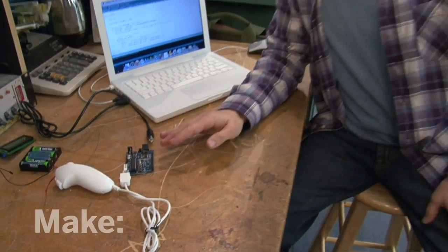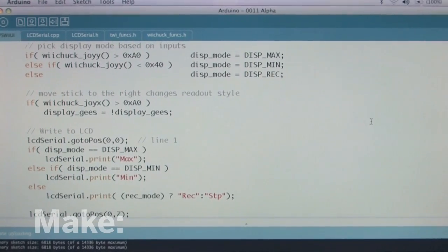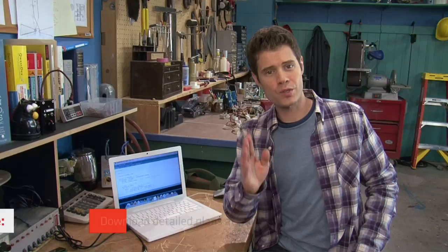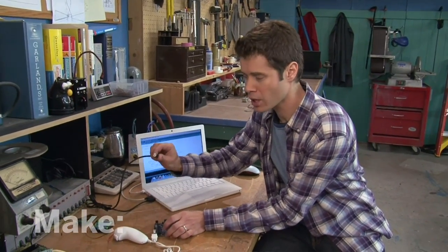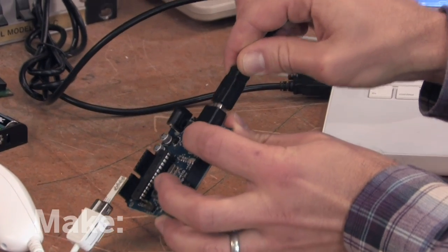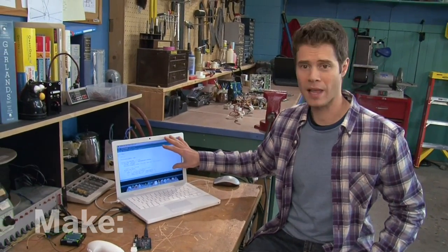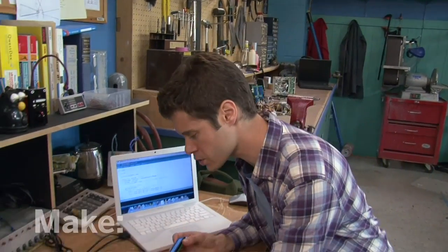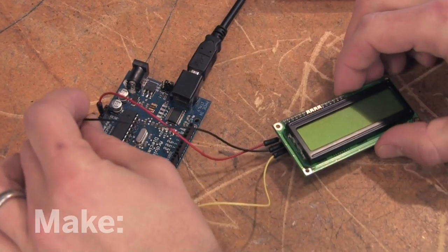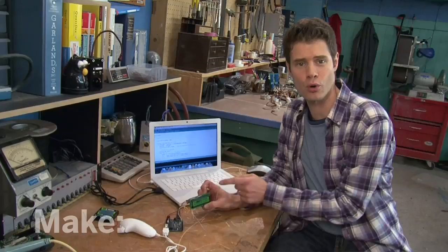To make all this work, we have to program the Arduino and tell it what to do. Don't let the word programming scare you. Arduino comes with a very simple programming environment, and there are a lot of books and websites out there to help you learn. We've put this program up on the website so you can download it and use it in your project. I'm going to plug in the USB cable from my computer to the Arduino and click the upload button, which will send this software from the laptop onto the microcontroller. Once that's there, I need a way to see that data, so I'm going to use a little LCD screen. I just plug in three cables: one for five volts, one for ground, and the last one is the data pin. Now I can see the info coming off of the sensor into the microcontroller and onto the board.